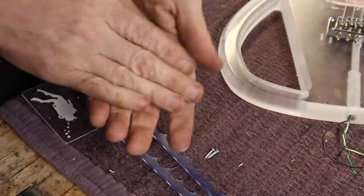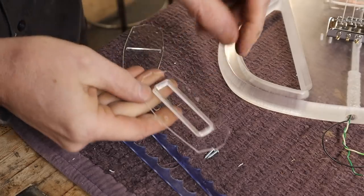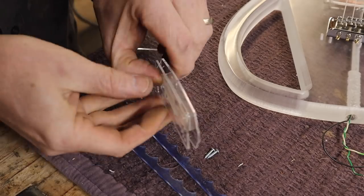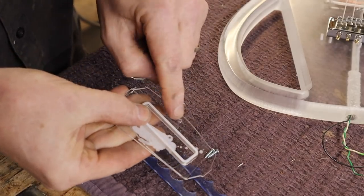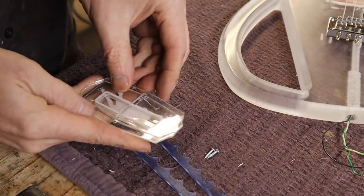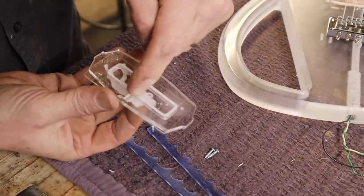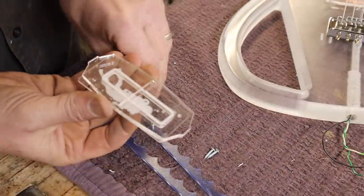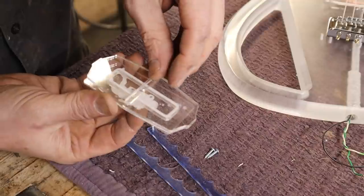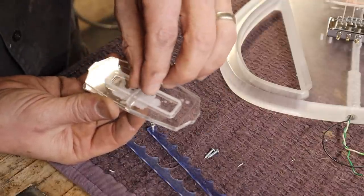I changed the shape of the bottom just a little bit. We'll do the same stack, put our magnets in, put the lid on, and wind it the same way. But this time when we wind it, we run our positive or negative through holes to the back and solder them right down the center where the second back plate will go. All the soldering happens in that space, wires are secured, we can add a little epoxy, tie them in a knot, and then run them through the last piece that fits right into the channel in the middle of the guitar to act like a track.